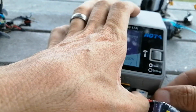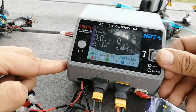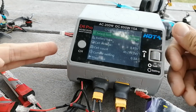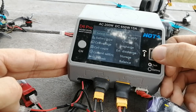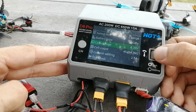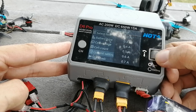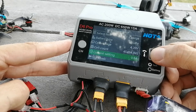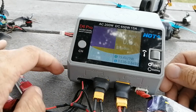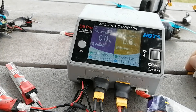This is a small 4-cell pack I use for my explorer. On channel two, the cell voltages are all at storage. I select charge, this is not an HV pack so I select LiPo. It's a 650mAh pack so I'll use approximately 0.6 amps for 1C. Off we go — on one channel we've got a 4s battery charging, on the other channel four whoop batteries going to storage voltage. These things are completely independent and it's just fantastic.